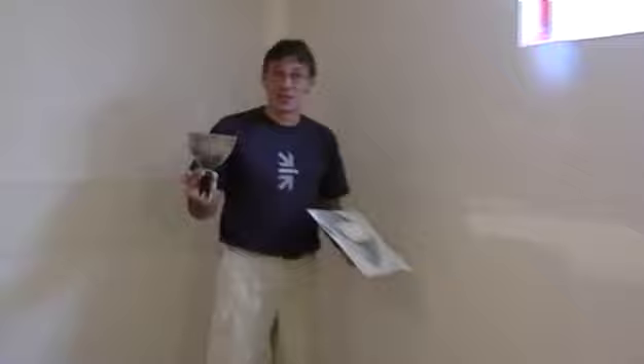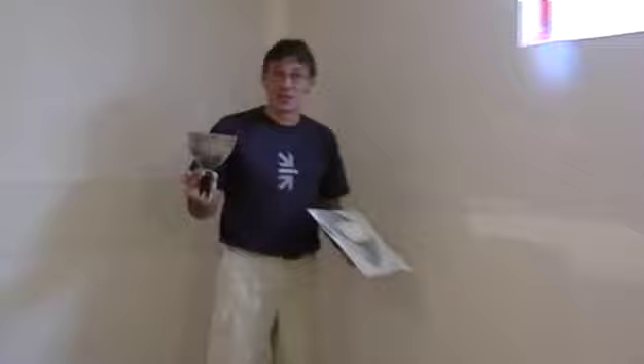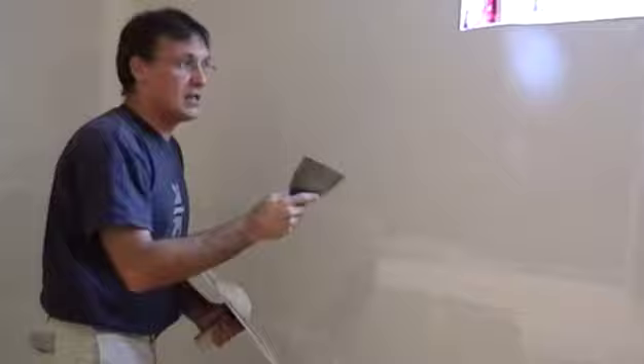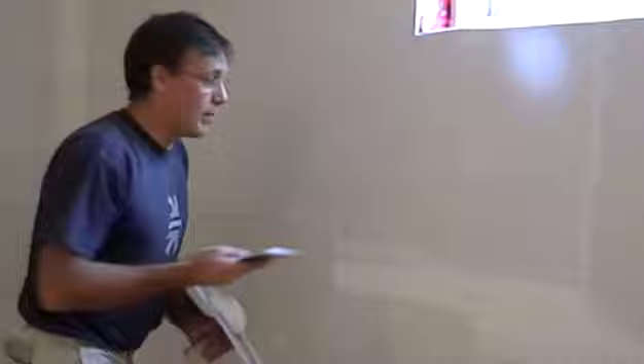I'm Laurie Desermo and I'm back. This is the Art of Taping Drywall. This is a six-inch knife - it's used for second coat on the screws. When you buy your six-inch knife, if you lay it against the wall you'll see an arc on it. That allows you to leave a layer of mud on your screws without leaving edges on the other sides. The technique is very similar to the first coat except it's a bigger knife and there's more flexing involved. All I do is load up with mud this way on the screw. It's a combination of flex and lay down to determine how you leave mud on these screws without leaving edges on the outsides. If you do leave a little bit of edges, the finished coat done with the trowel takes some of that away - so there will be no sanding on these screws before the next coat.